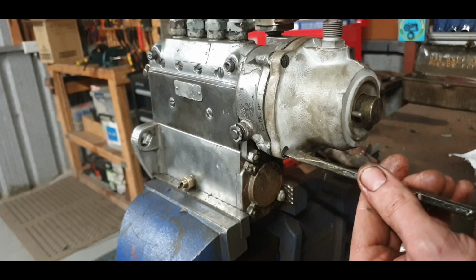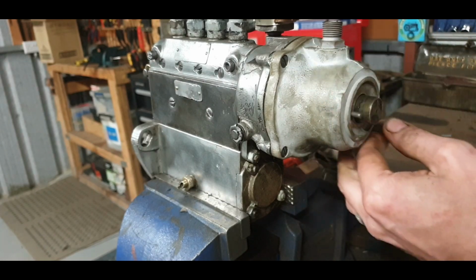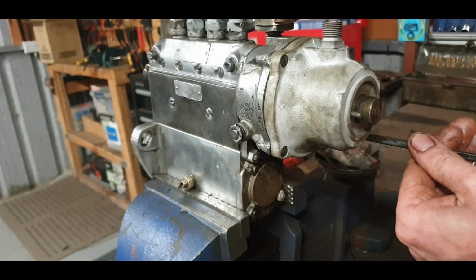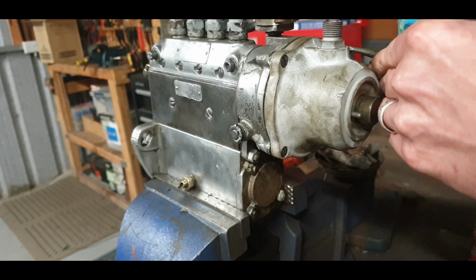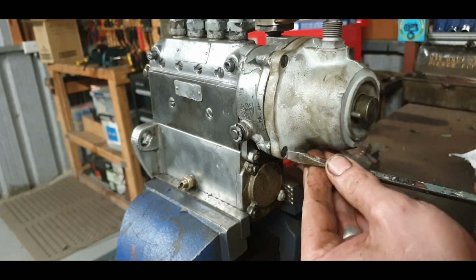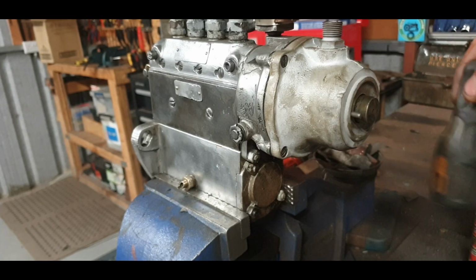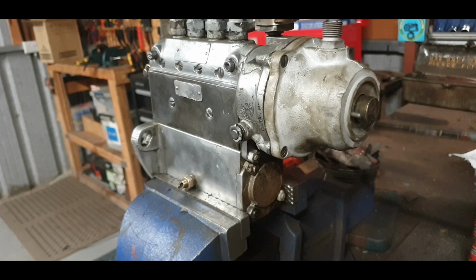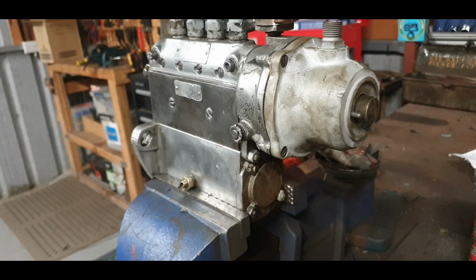So you want to have it pulled nice and level there. Just like tightening down a rocker cover and all of that. Tighten down your rocker shaft. You don't need to be savage tight. If you do your prep work like I've done there, it's a lot easier putting this on here than on the tractor, especially because you don't have a lift pump here, and that's going to only give you a small amount of space, so you need a proper short screwdriver. If you're going in at any angle, you can take a chunk out of the slot. So that's that.